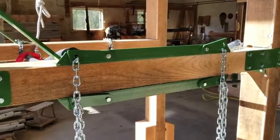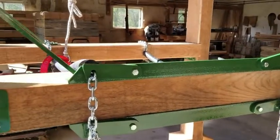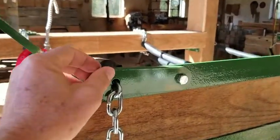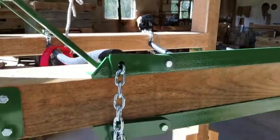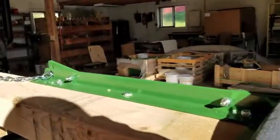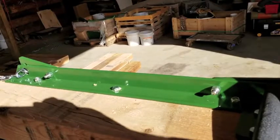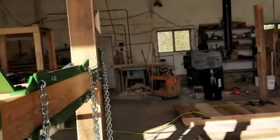The next thing you need to do is attach the chain locking mechanism. I believe that's a 28-inch angle. These will not be attached — you will have to attach that yourself with the bolts that are included. To attach these, you will need to drill three holes through the cross tie and attach the angles using the three bolts with lock nuts that are included.